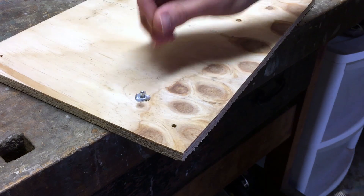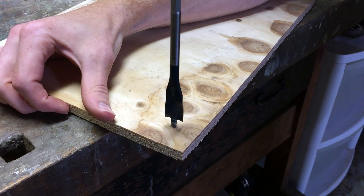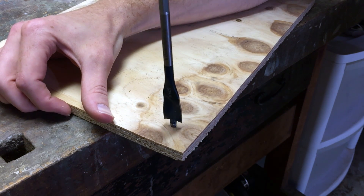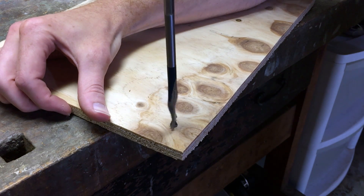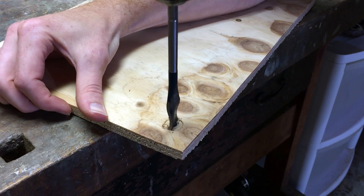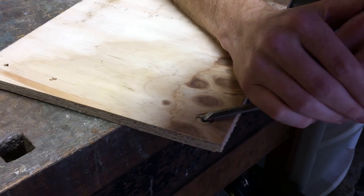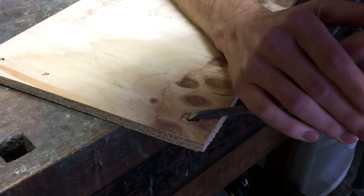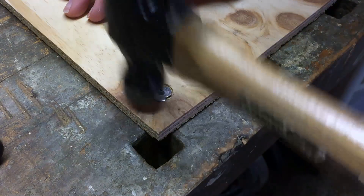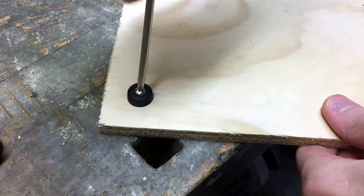After that, you can partially drill a bigger hole to countersink the back of the T-nut. The best way to do this would be with a Forstner bit and a drill press, however all I had were these self-tapping paddle bits, which are probably the worst thing that you could use. But if you just go slow and make sure you don't go right through the wood, and use a chisel to clean up the hole, then it will work out just fine. Once that's done, you can pound the T-nut into the plywood and flip it over and screw in the rubber foot.